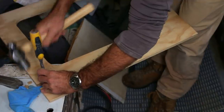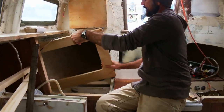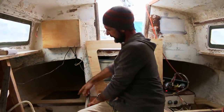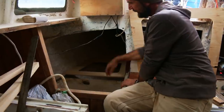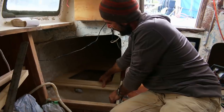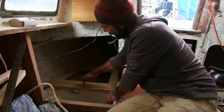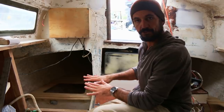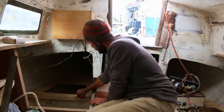Back at the boat we did a bit of custom fitting and measured up the support piece for filleting into the locker bulkhead. There's a divider there — it's a half inch down, it will be resting on there and that will make a solid connection. It can be screwed down and glassed in, and then when those go on top, it will join it all up, support it, and it will be a very strong quarter berth.